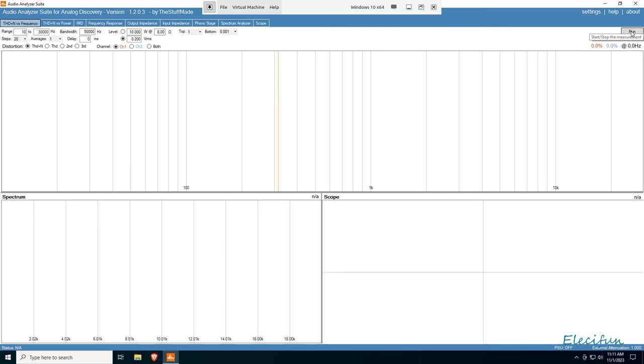All right, and we have our first there at minus 76. Here you can see the numbers here, minus 93, and at the frequency. So here at our 2 kilohertz, I believe that's going to be 595 hertz is our first harmonic, and that's in at -74.2, and that's the highest as well of the harmonics. So that's pretty good all around. And the second there, -81 at these frequencies, sorry. So when we look across here, we can see this is all pretty much below the 0.1 until we get to about here, 0.96, and we go 0.1. But this is with the noise as well. So let's just filter out the noise and we'll look at the THD.